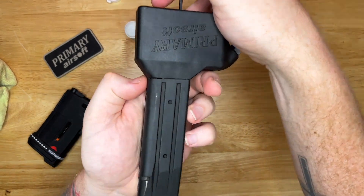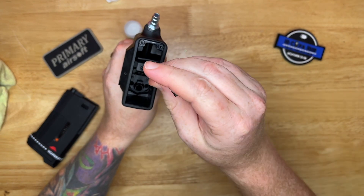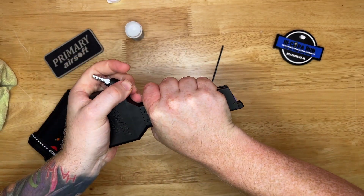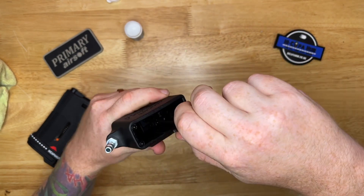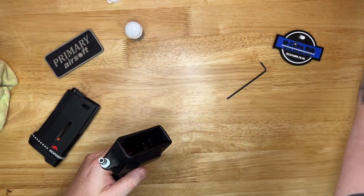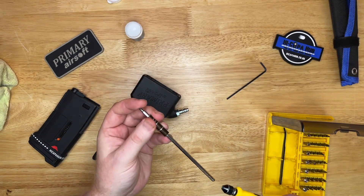It's finger tight at this point and you can still see a little bit of a gap there — that's because I haven't really pushed on it much. So what I'm going to do is just push it down a bit to help seat that o-ring, then tighten a little bit more, and then a little bit more, and a little bit more. That makes sure you get a nice constant force — you're not just cranking it to the end and walking away. We're making sure the gap is closed and the seal is absolutely spot on. I want to do it once, do it right, and have it be absolutely perfect. I've also got my screwdriver set to apply a bit more pressure, because with an allen key you get a lot of twist and flex.